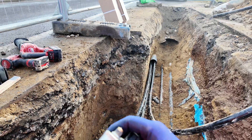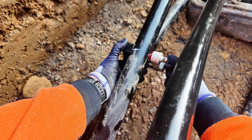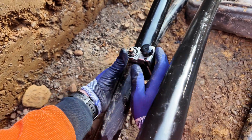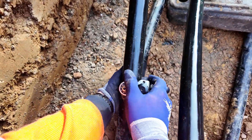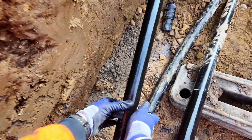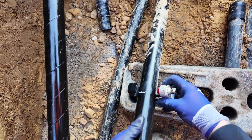This can be used — I think it's every 0.1 of a mil, up to I think 16 mil, but I'd have to double check. All I'm going to do now is a circumferential cut, just above the earth screen wires so it doesn't touch them, and then you have three different spiral settings to work my way back up the cable. Every jointer should have one of these tools — it's far easier to use than a set of PG3s.